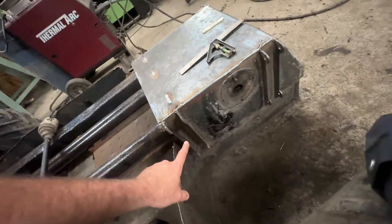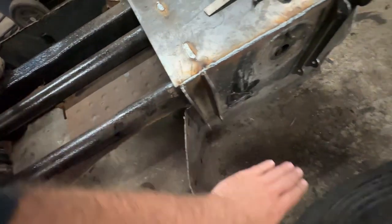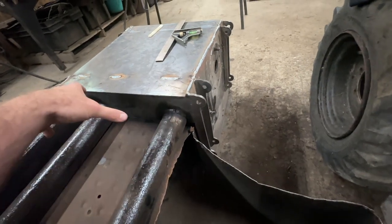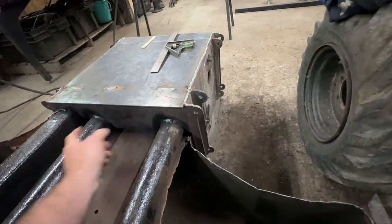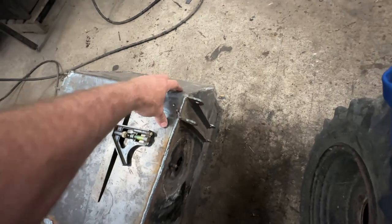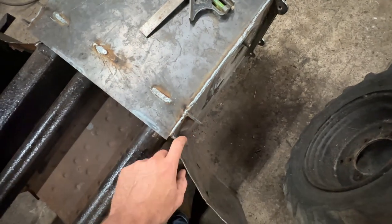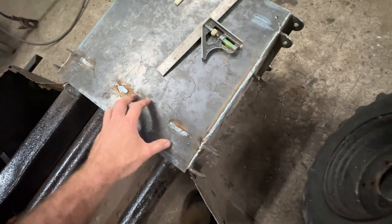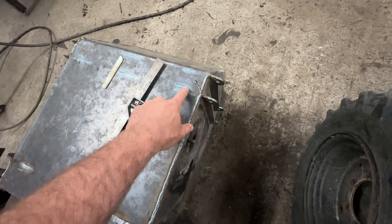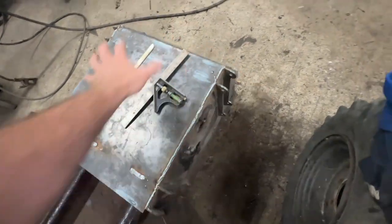This is your underside of your chain case, because that's where your chain runs. To tie this together, I actually went to the table and cut some 3/16 thick material here. These are our eyelets for our control arms. I then semi-circled them and slid down over the chassis and welded — same with this one in here. This one is actually tied together by this 1/8th plate, so this is all 1/8th thick material here. I slotted and plug-welded to tie those two together, and this one I was able to weld out stitches — yeah, I have everything tied together there.